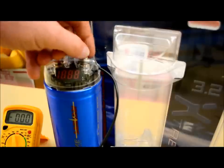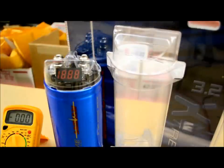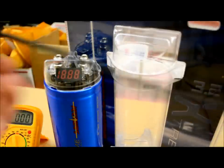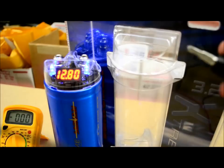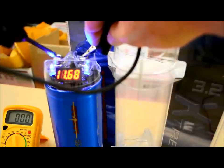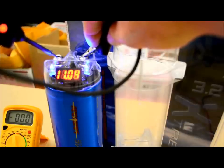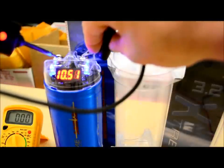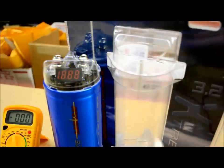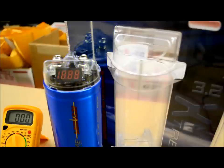Now I'm going to show you something else. When you disconnect the power, I'm going to take my test light — this here is my test light, which has an auxiliary ground so I can use it here. Put my test light on there and you can see that when I touch it, my light is coming on and the voltage meter is coming on because it's sensing activity. You can also notice that the voltage has gone down from 13.6 — now we're at 10.32, going down by about 500 milliamps. You can see it's at 9.327. It's steadily going down — this capacitor is actually discharging very rapidly.